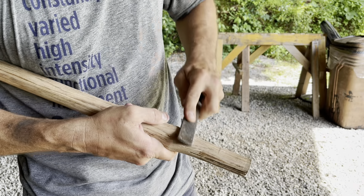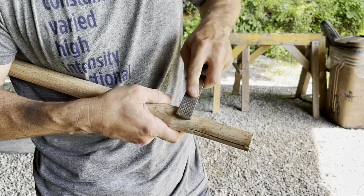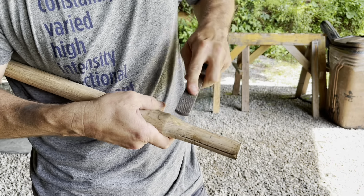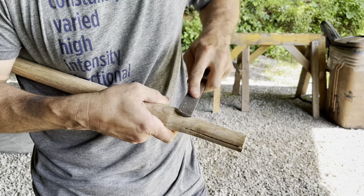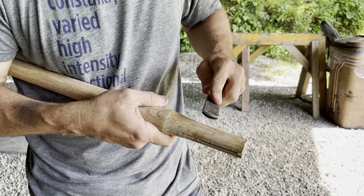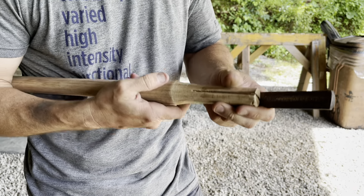You don't have to take all this time to do something like this. However, if you want your axe head to stay on for years and not work loose eventually, then it's really important to take this kind of step in the beginning and make sure it fits as tight as possible. If you can make it fit super tight in the beginning and keep adding oil to it — never let it get super dry — if you add oil to it on the regular, it won't work loose on you.